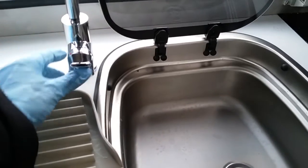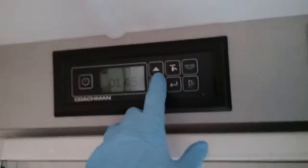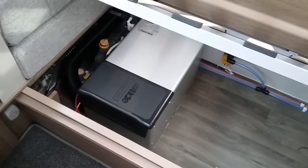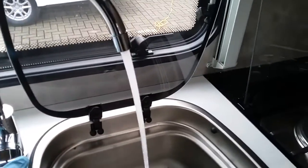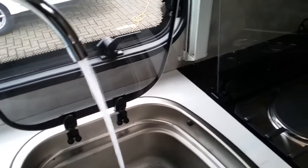When refilling the boiler, close all the taps, close the drain valves again, fill up the aqua roll, drop in the submersible, and then turn on the water pump. The boiler will then begin to refill from the aqua roll. Let the submersible run for a few minutes and then begin opening the taps — they'll cough and splutter as they force all the air out. Once running freely on both hot and cold, re-close and the system will fully re-prime itself.